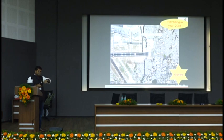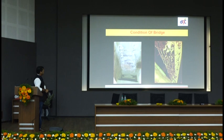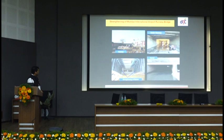The condition of the bridge below was very poor — pieces were falling down. They had carried out jacketing 10 years before on this almost 50-year-old structure, but all the jacketing was falling off. Any overhanging structure — when you add additional mass — will debond over time. So never retrofit with high-mass material on an overhang. Jacketing is fantastic for columns but not for slabs and beams, as it will delaminate after a few years. What we did was first apply micro concrete and then fiber wrapping, the first time used in any infrastructure in 2008.